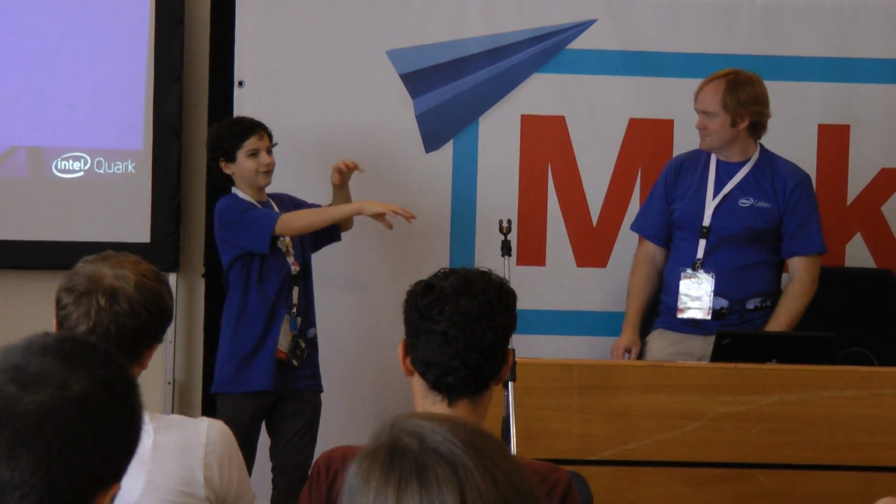The box here at Maker Faire, you open it, and depending on how bright it is, you either have to open up the whole box or just remove the board. There's a little board with a blob on it, some batteries, a speaker, a photodiode, and I believe a 3 meg or 1 meg resistor. When it goes from dark to light, it'll trigger. First it was like, okay, how does it work? Then, I wonder where I'll put it. Oh, I know, I'll hide it in the fridge. And then I realized, I wonder if I can trigger it with the Galileo.